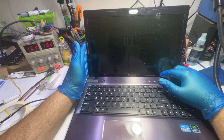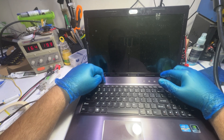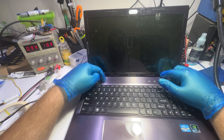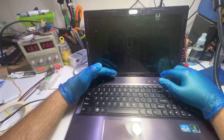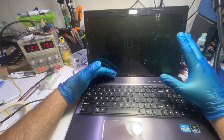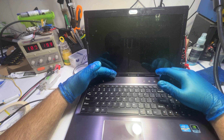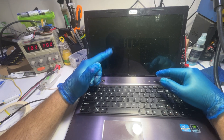So what could be the problem? Let me turn off the unit for a moment. It turns off. Now let's get into BIOS mode. We hit the command in BIOS mode. It's the same thing — that means maybe we have a corrupted BIOS on the board. Why not swap between the two BIOS and see what will happen?